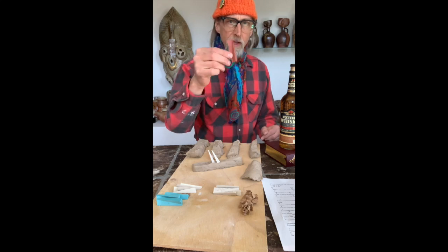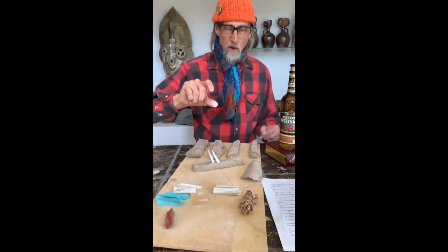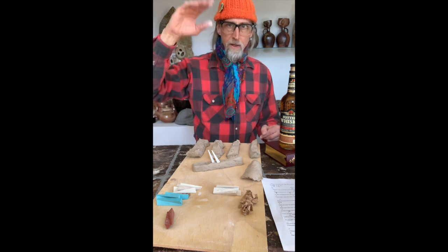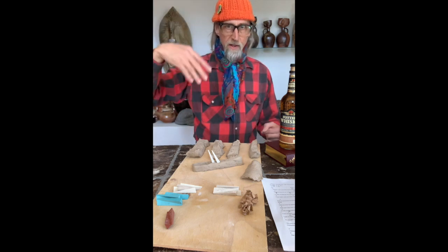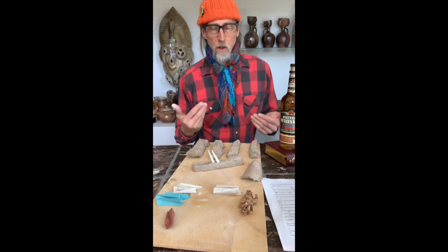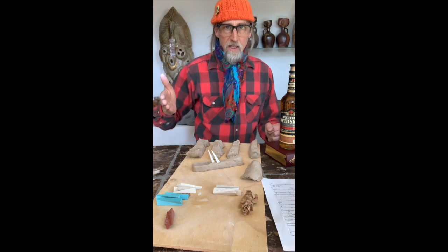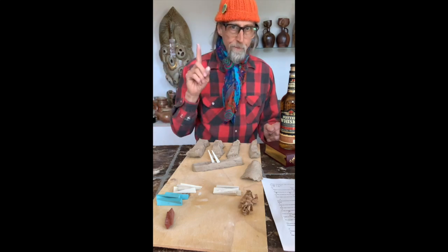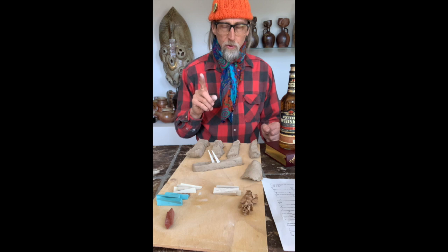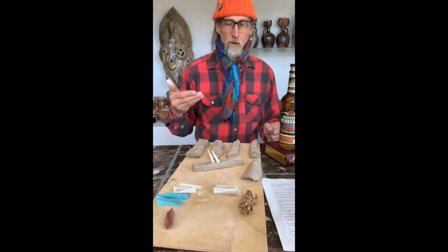So I'm going to have these as separate ones. I'm only going to put one in the front on top, one in the front on the bottom. I'm going to see which one goes first, and then I'm going to start putting some back pressure on the kiln and allowing that to go into a body everywhere. In the back, behind the side stoke, I may put a body cone too, but visually, again, I can see what's happening. So I want to look at that also.